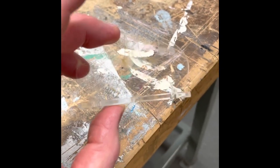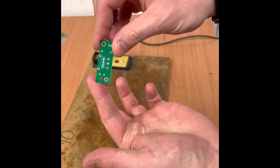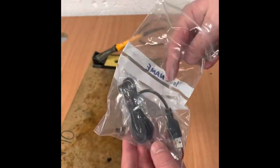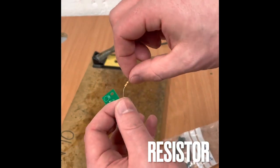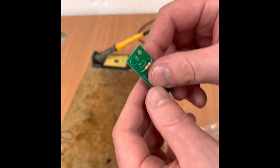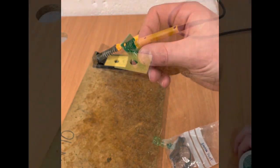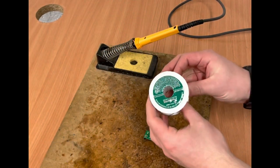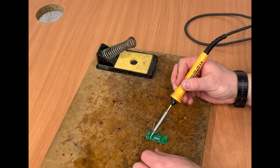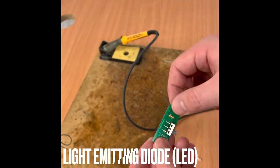We're then ready to start creating our LED light using a printed circuit board, which has all the different components labelled on it so you know where everything needs to go. Start with the resistor — everything is in your bag, make sure you write your name on it. Bend the legs gently and put them through the holes. We're always going to be soldering onto the silver discs on the back, so poke your component through and bend the legs out slightly so they stay in place. Get some solder, and using a soldering iron — be careful, it's very very hot — hold it like a pen onto the plastic parts only. Use the sponge to wipe off any excess solder; we're looking for shiny volcanoes.